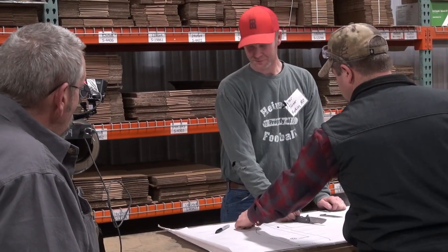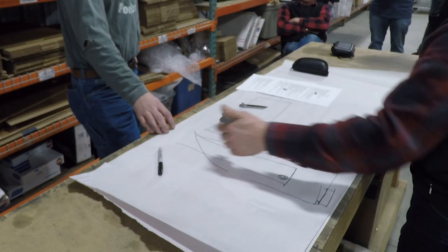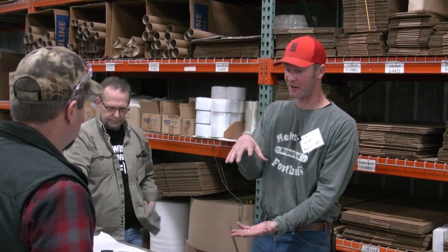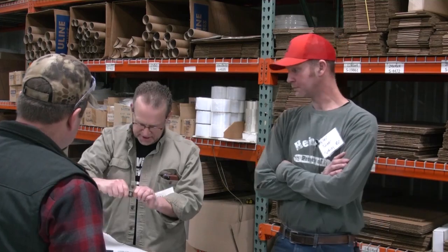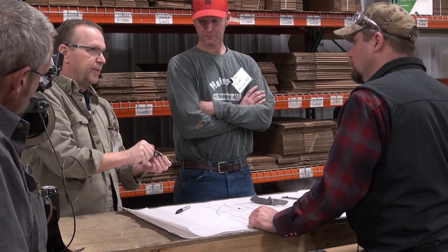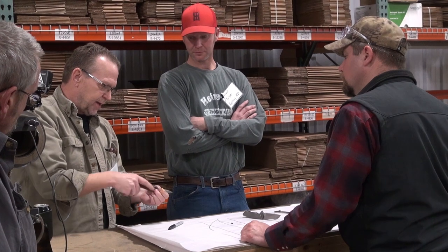And then back here, that also is going to determine how tight that's going to be. And your height back here is going to determine a lot of how much you're going to have to relieve, because you're talking way more surface area of titanium. You're going to push down and see if your bar flexes. So on your first prototype of a model, if you can, torque it, try to close it, and if that flexes, go bigger.